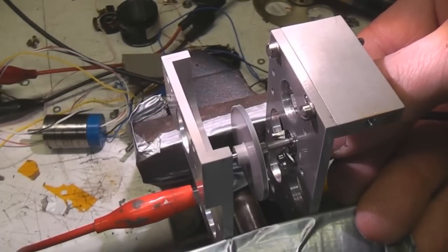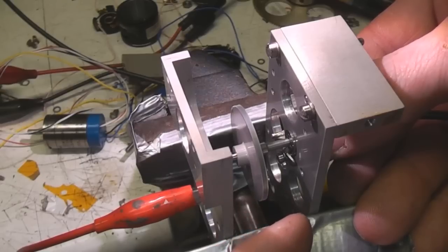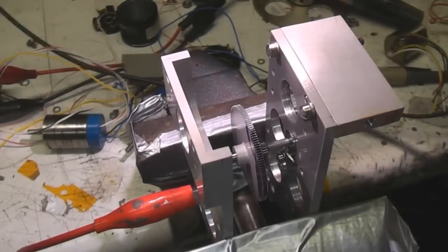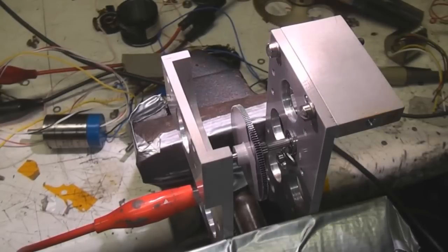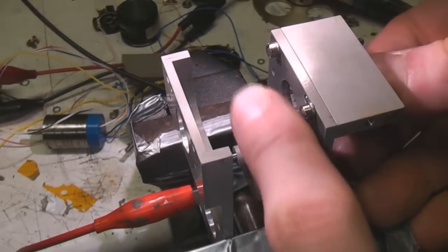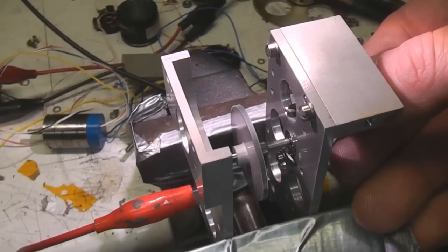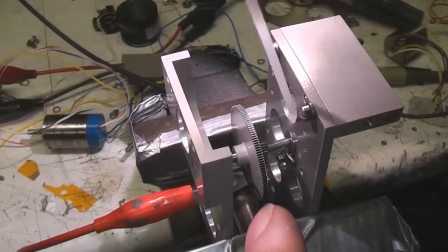And they will actually go pretty fast when they get going, but they'll generally start to slow down a bit. Yeah, it's dying down. Getting a little bit of smoke coming out of the bearings now. Sometimes when they cool down they'll restart, but sometimes the actual surface of the balls gets pitted, so they're just not very good bearings anymore. Use some freezer spray to cool them down a bit.